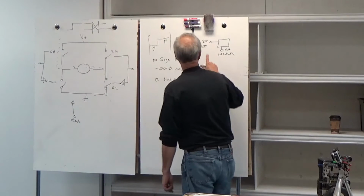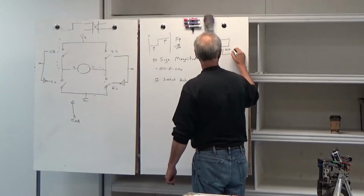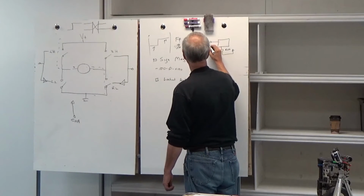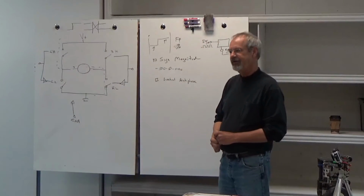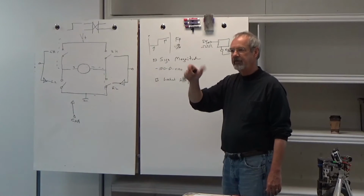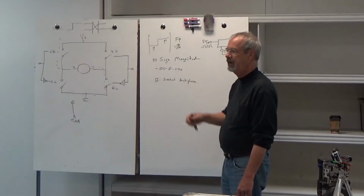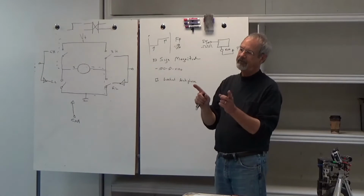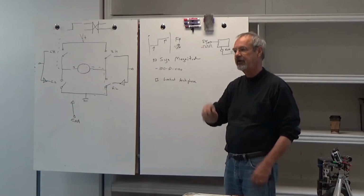Locked antiphase, what we're going to do is just hold the enable pin high. We're going to drive the pulse width signal into the direction pin. So that means the direction is going to be switched back and forth at the pulse width modulation frequency. If we're at exactly 50%, then you're going to be going forward and reverse, and the currents will cancel each other out, and we get 0, and the motor doesn't turn.